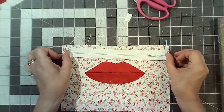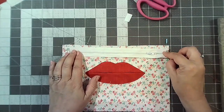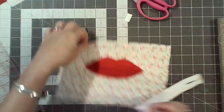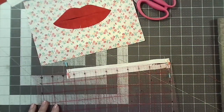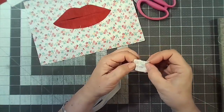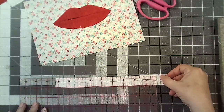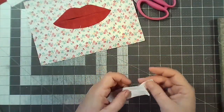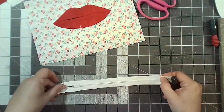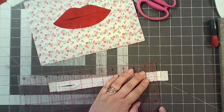Hopefully if I've done this right it should fit in those lines — wait, it's not fitting. That should be nine and a quarter but it measures nine and three quarters. Oh, I measured it wrong! When I marked up I did nine and three quarters instead of nine and a quarter. Silly me — I'm going to have to chop a bit off and redo this end.